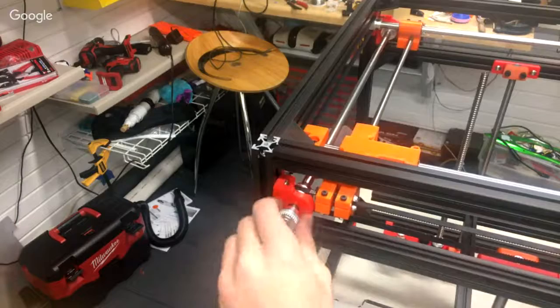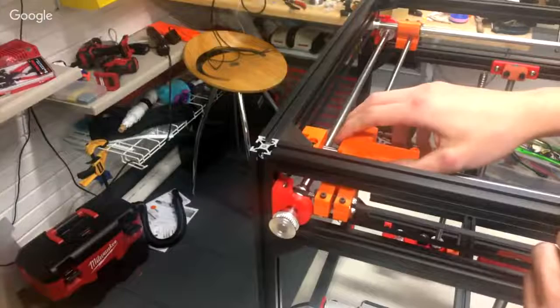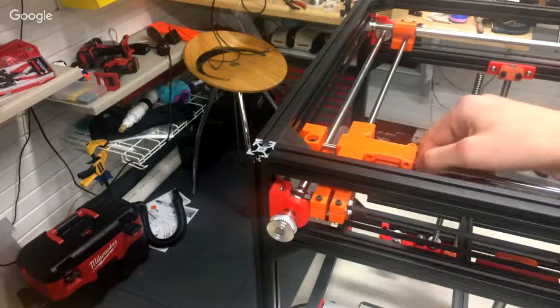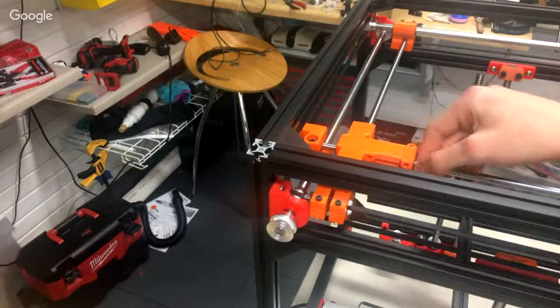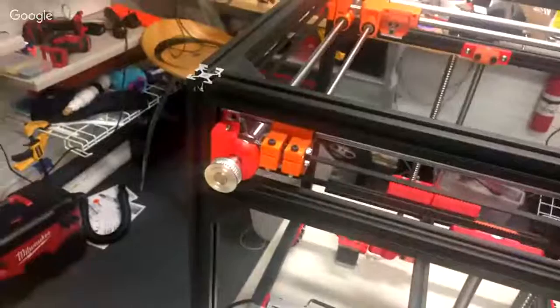Okay, there we go. So I think let's move back again. And now one thing I'll tell you, the ones that get the pulleys on them, if you think about it, you're tightening it unloaded. Once you put that motor and belt on there, you may have to tweak around with it once you get it set. Hopefully we'll get all these four corners and you'll feel that it'll start to kind of smooth out. But when you put that motor on there and you tension that belt, it's going to want to deflect it down so it can kind of re-pull things out. Or just like to the side. Yep. And then we'll do the same over here. Yep.